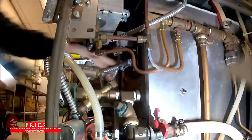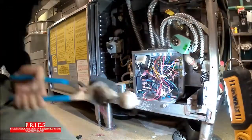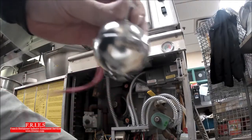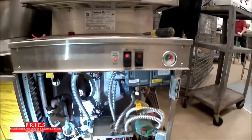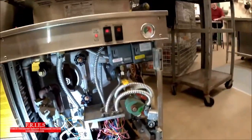We're going to remove this secondary low water cutoff switch — I do have a new one. You can see the old one is scaled up pretty badly. I tried ohming it out to see if I could clean it and make it work, but that thing's done. In there you can see the high and low probes, so I'm going to clean those while I have the chance. Everything's cleaned up and the boiler is actually in good condition. Note: the new float switch — if it comes upside down it will not work. There's a normally open and normally closed, so make sure you test it.